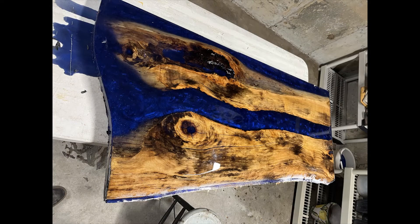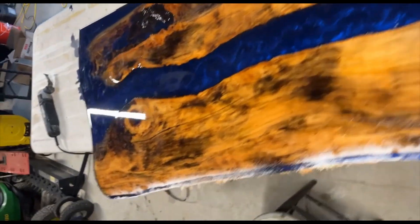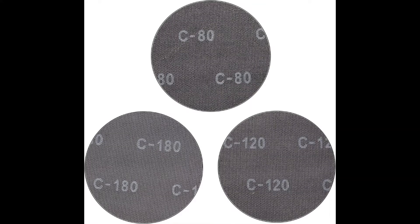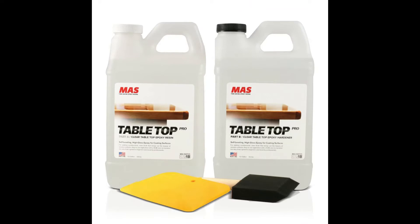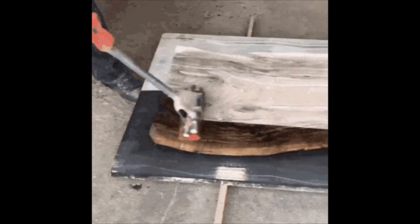Once it's out, take a look around and see what you want to clean up. The first thing you'll want to do is router the edges — mine came out really sharp from the way it dried, so I used a router to smooth them out. It's a nice finishing touch, though you could also just sand them. After that, you need to do one more pour with the tabletop epoxy. It's harder and easier to clean than the deep pour, so if you don't want it to scratch, do this final coat.